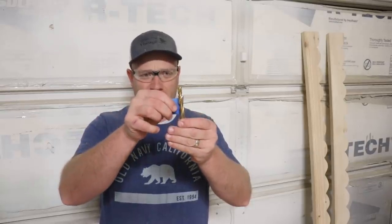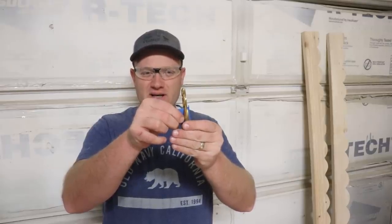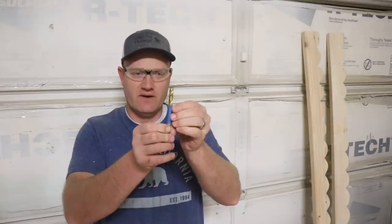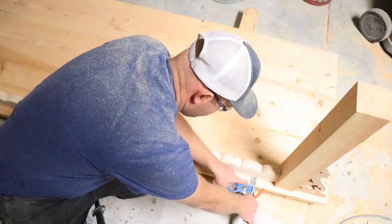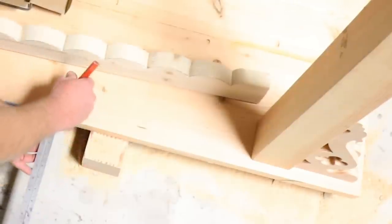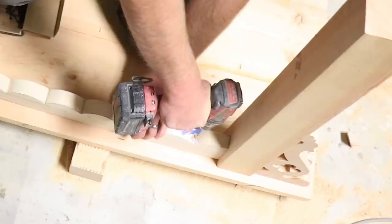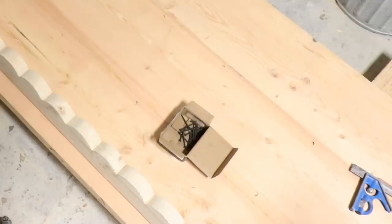Making a tape flag here — just a piece of masking tape. I want to cut down into the wood about an inch and a half. I'm using 2 inch screws, so that'll put an inch of the screw into the tabletop and an inch into the skirt, which should make it fairly strong. That's how I know when to stop — that's where my depth is at. I'm measuring the skirt an inch and a half in from the edge of the table — that's where the skirt's going to sit and where I'll attach the supports for the legs. I've got to secure this right here in the bottom of the scallop. I'm going to drill down in with this 3/8 drill, down to the level of the tape flag, and same thing on this end.